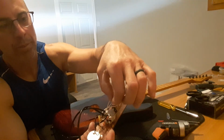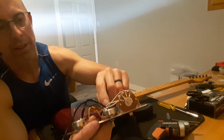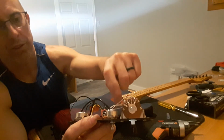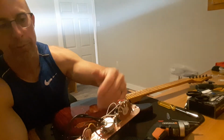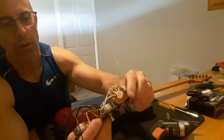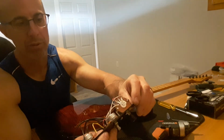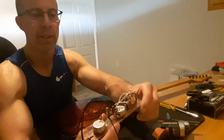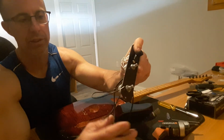This one, the white one going to the far peg on the switch, and the thicker white one going to the closer peg on the switch. Both of those are extremely short. The other ones, there's plenty of play, and you can move them around, and all the solder joints look good. So I think it'll still work. It's just it'll probably break over time from stress because it's super tight and it won't even move. So anyway, those three things would make it better. But these plug and play things look really cool.